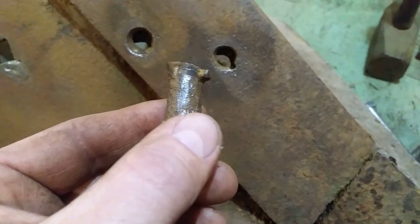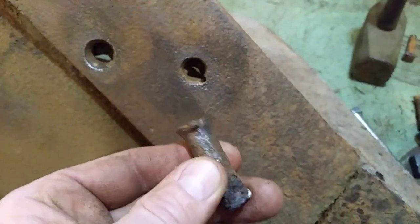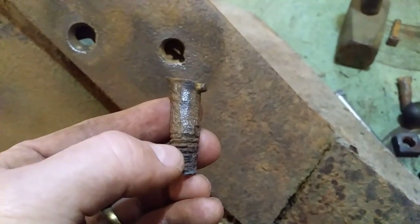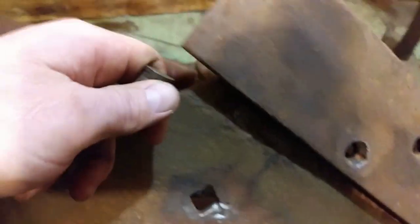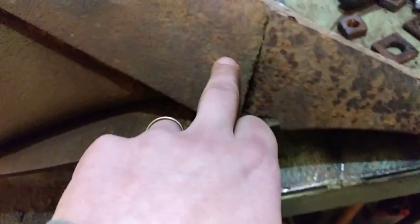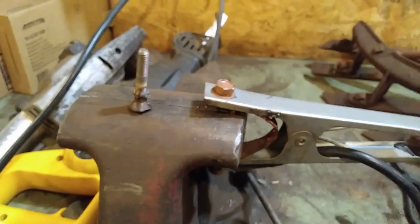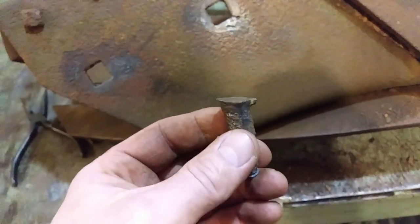The bolts come out of here — there's just a little groove on the bolt head and a notch in the plate that keeps it from spinning. The best thing I'm thinking to do is cut that head off and weld a new bolt on. I pulled these two out, then cut the head off a good bolt and the shank off the bad head, and welded them together. I'll let it cool, grind it smooth, and we'll see if that works to replace these.